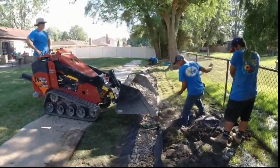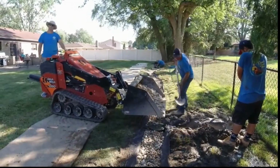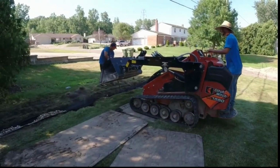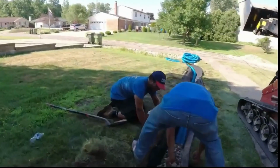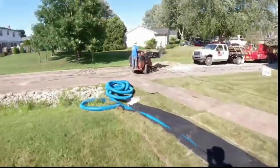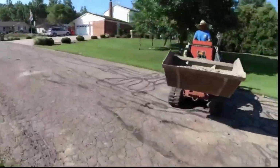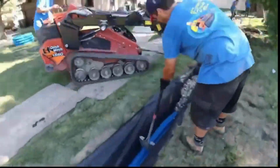So what that is right there is a little feeder into this spring. The spring's really hard to chase, and it's going to jump around a little bit in this vicinity. So we went ahead and put a little branch off the main in there because we suspected there was some spring activity. There's this area where there's just a lot of seepage, which is the problem when you've got these springs, and they have a tendency to move around a little bit too. So you really want to run a couple of feeder pipes up into a situation like that, guys.